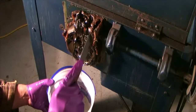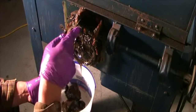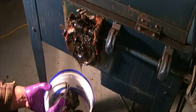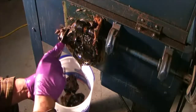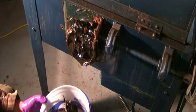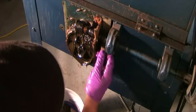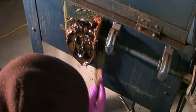There's a piece of cork gasket here. I'm going to be careful with that and leave it there. Nothing has leaked out of here. That cork gasket right here has done a marvelous job for who knows how long. I don't want to have to put one back on. It's the evidence of a gasket that was on there. I may have to make one. Or we'll just RTV it. That might be the simpler solution.